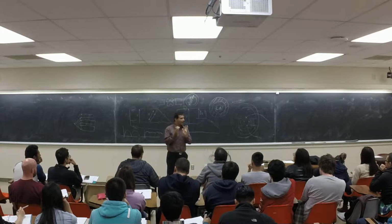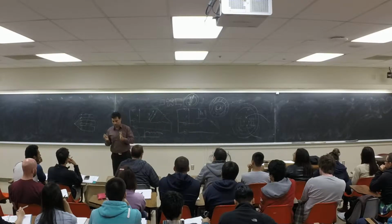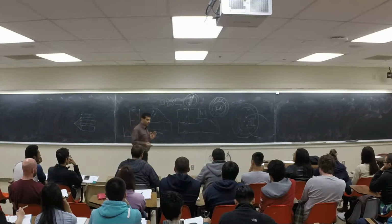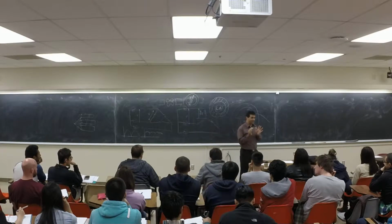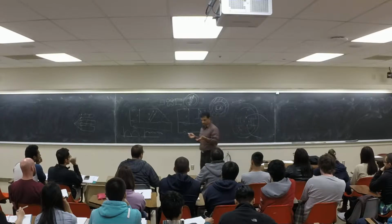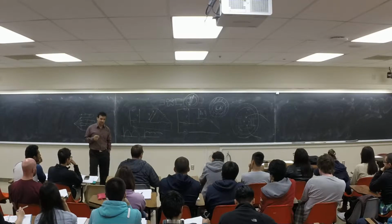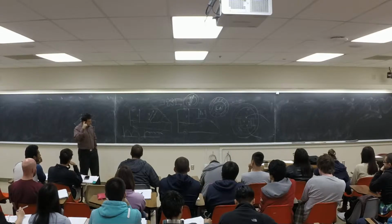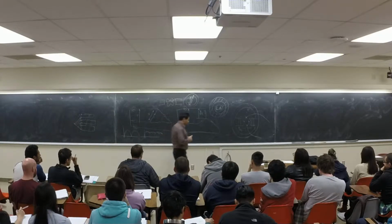And for mobile applications, volume and weight are very important, right? So that's the main reason everybody is using permanent magnets. They have very, very high torque, and the size is pretty small. But the problem with that is they are getting more and more expensive. And there are people trying to find another way to go around magnets if they can. We're not going to talk about permanent magnet or switched reluctance machines. We're going to start with this cylindrical machine.